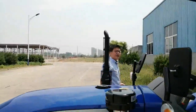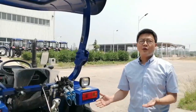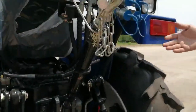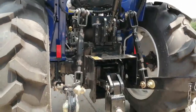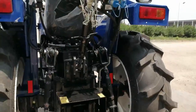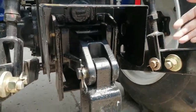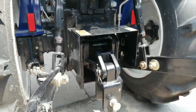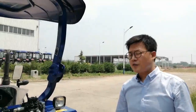Finally, I will introduce the three matching operation modules of this tractor. First, with the reliable lifter and stronger C-81 three-point linkage, it is more reliable for farmland work. The standard uses a 22mm traction rod, and optionally an enhanced 24mm traction rod. The roller coupling position can be adjusted and the trailer does not block the PTO output.